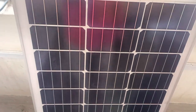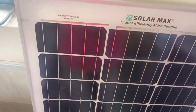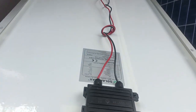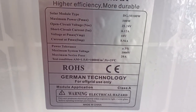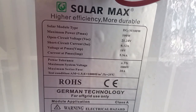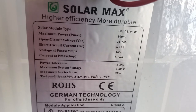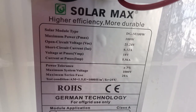The monocrystalline is usually the most efficient and the one that we usually recommend. When using monocrystalline PV solar panels, you're likely to use fewer panels compared to polycrystalline. So let me take you through the label on the back of the panel. As you can see, it gives a maximum power of 100 watts. The open circuit voltage is 21.24 volts. The load voltage — the operating voltage — is 18 volts. Then we have the short circuit current of 6.12 amps, and the maximum current is 5.56 amps.